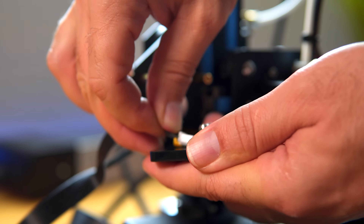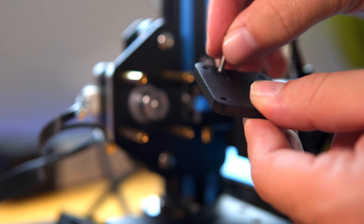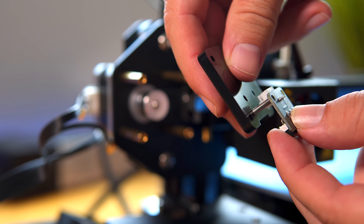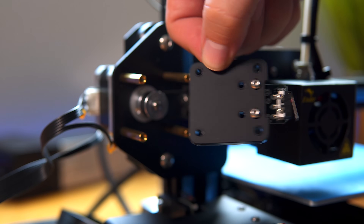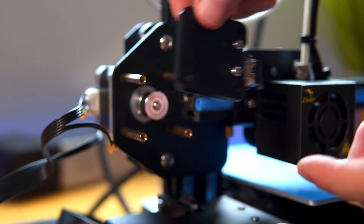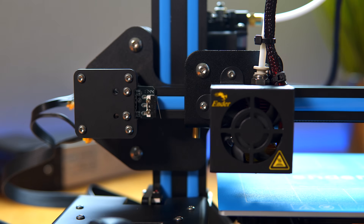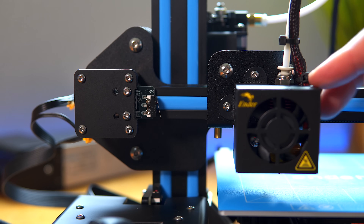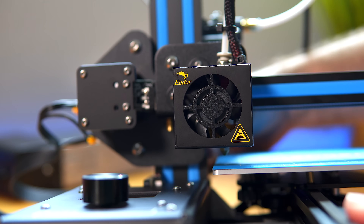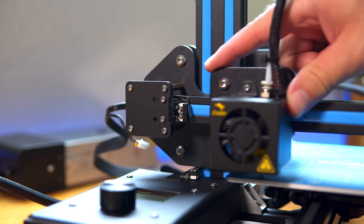Let's go ahead and unplug it — that's what we have to work with. We drilled a couple holes right there, so now we can put our little bolts in there and the circuit will go right back on. The switch is on. Unfortunately I didn't drill the holes too straight so it's tilting a little bit, but that's okay. It's back on and now we have a new home point for the X-axis. It's going to come in and stop perfectly in line with the bed where we need it. That's the new home point now.